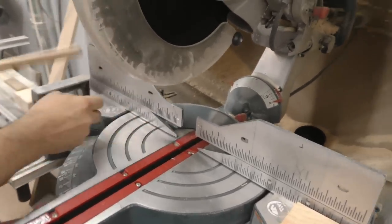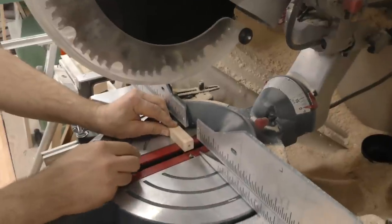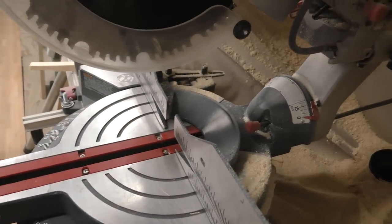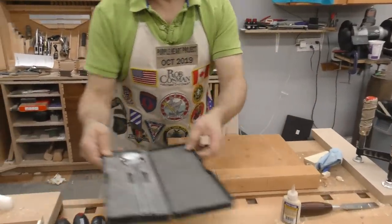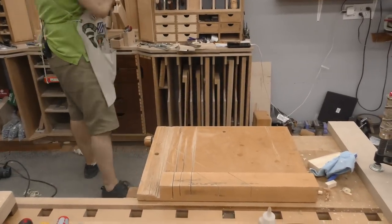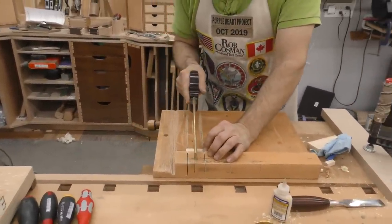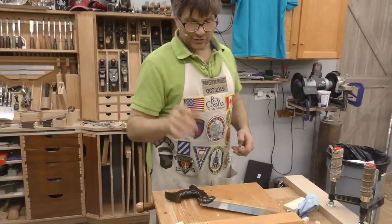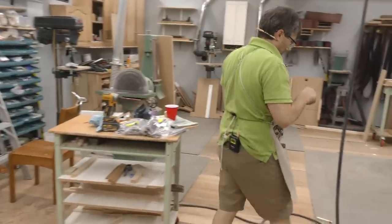If you put a straight edge on there, this has been bent just from years of being slammed. You go in there to cut it but it has no support — you try to make that cut and next thing you know it grabs it and throws it. Lucky if it doesn't hit your finger. So instead, when you're dealing with small parts like that, you're far better off to make a little bench hook and get yourself a Rob Cosman crosscut saw. Little jobs like that that are notorious for hurting people when using power tools are really safe.